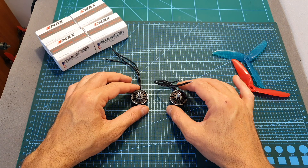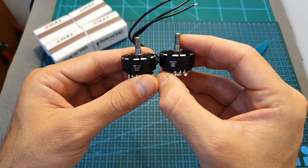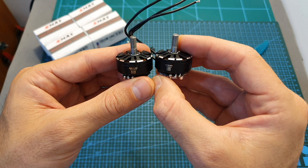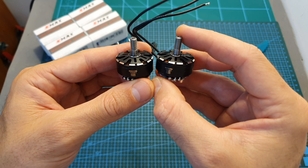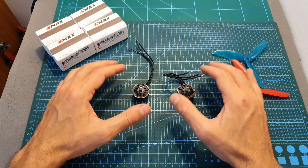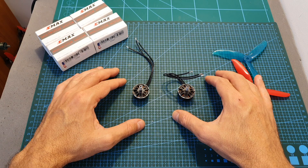The next thing I've done is bench test both the 1700 and 2400 KV versions. After going over the results, I can tell you that they're very similar to the thrust test results of the Emax Echo 2306 motor. Since these motors cost almost double the Echo motors, I think that unless you really need the cool LEDs on the bottom, you should go with the Emax Echo motors. I'm going to show the thrust test now, and in the description box below you can also find a link to the full test results.